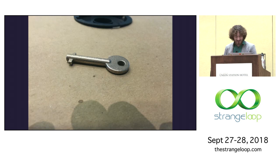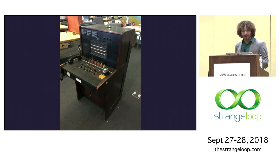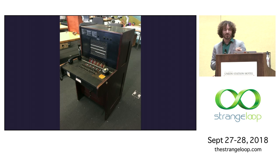Even then, you open it up and you see this weird mass of wires — but not wires that make sense. If we take a step back and look at the front table area of the switchboard, conceptually there are a bunch of different columns, where a column has two cables, two lights, two switches. Those are linked — so if you have two cables plugged into two different ports representing telephones, and you flip things correctly, those two people are talking to each other. There's a front-rear connection, so the front-most cable connects to the front-most light and the front-most switch.